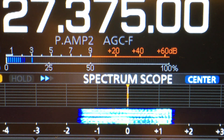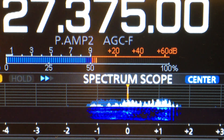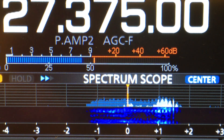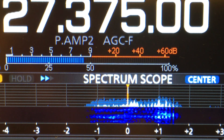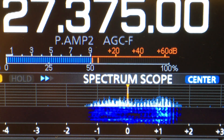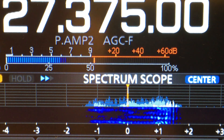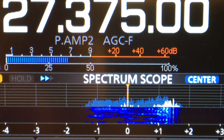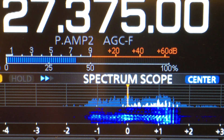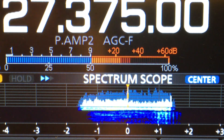No drummers. Trevor, you come back on your personal. The whole idea of stacking is you get the extra low angle of radiation - even lower than a cubical quad when you stack two Yagis. So therefore you get less down angle, stronger signal.